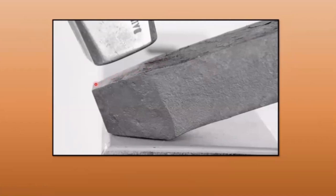And I want you to start to think about pushing the bottom of the jaw out past what will be the nose. And in real life, is that what happens? No. A bear has a very strong nose, and the nose is forward of the mouth. But in forging of the mouth, when we cut that jaw, there is going to be some upsetting action taking place. So if you start level with or even behind the nose now, before you start cutting the jaw, it's really going to get pushed back and it's going to look wrong.